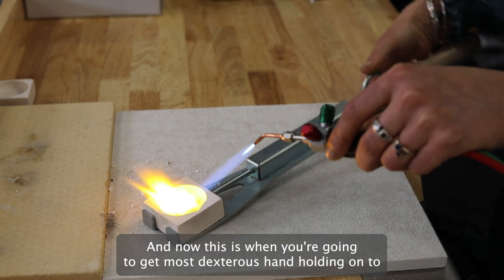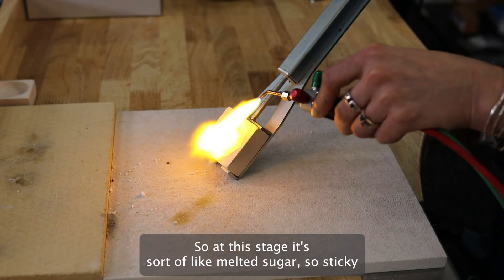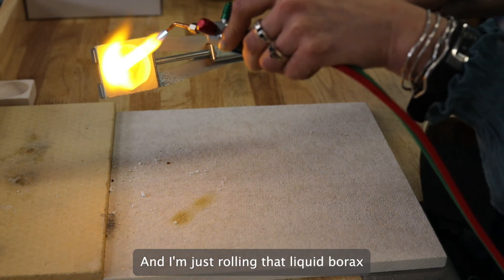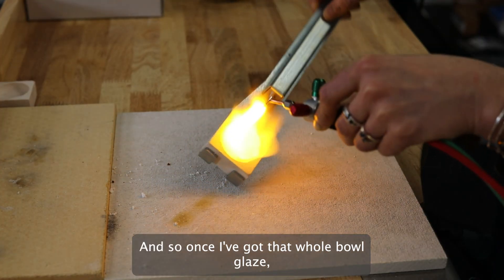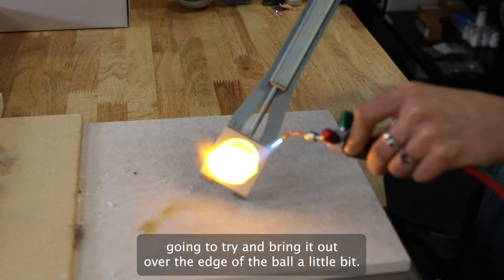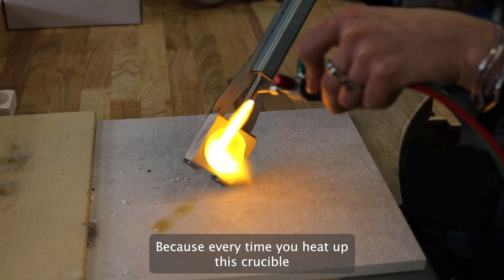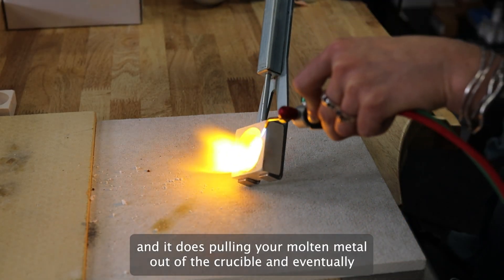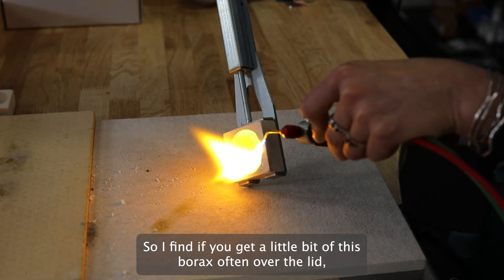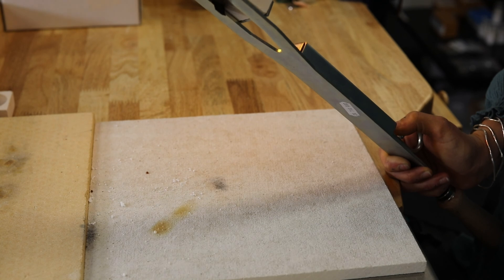Now this is when you're going to get most use out of holding the crucible handle, because I have enough liquid in there that I can start to glaze the inside. At this stage it's sort of like melted sugar — it's all sticky and it's going to move quite slowly. I'm rolling that liquid borax around the inside of the crucible. Once I've got that whole bowl glazed, I'm going to try and bring it out over the edge of the bowl a little bit. That's going to help the borax stay in the crucible for longer, because every time you heat up the crucible and use it, that borax turns into a liquid and follows your molten metal out. Eventually you won't have any borax left and you'll have to add more. So getting a little bit of borax up and over the lips gives it more strength to hold on, and you won't have as much pouring out when you're casting.